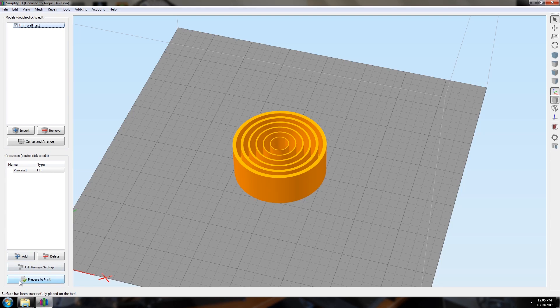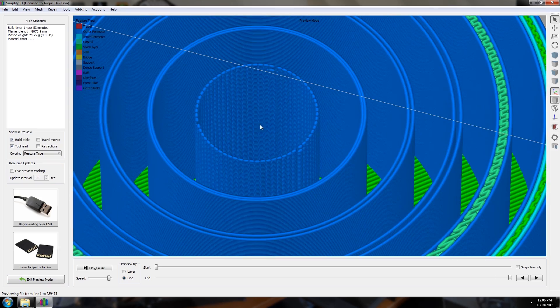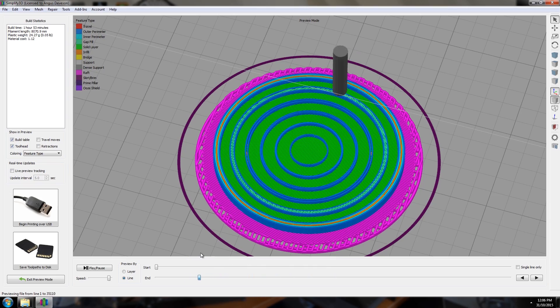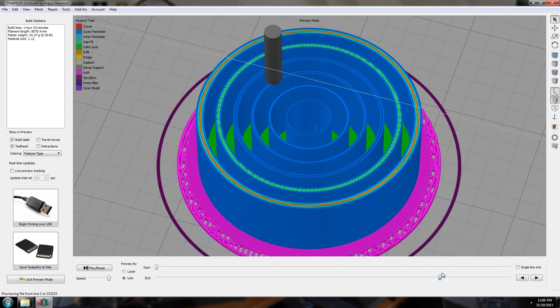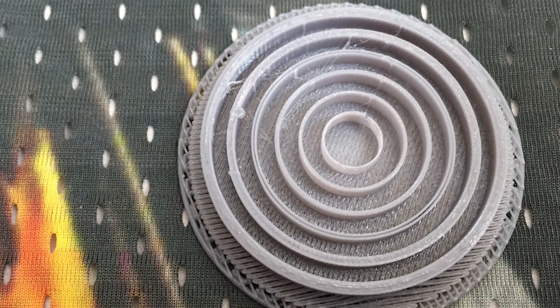So that's how the UP software handles thin walls — but how do other printers handle thin walls? Specifically, how does Simplify3D handle thin walls? Arguably one of the best slicers you can get at the moment, if it will run on your printer. So I decided to print the same model on my WANHAO using Simplify3D. The results from the G-code preview were really interesting — it's doing thin wall fills, and for the 1mm wall it does thin wall with no fill, not the 1.5mm, which is surprising. But when it gets down to the 0.4mm, it actually did this really crazy stippled thing where it ran the nozzle around once — not two perimeters, just a single one, turning the nozzle on and off really quickly. It was actually quite strange, but it actually printed, surprisingly enough.